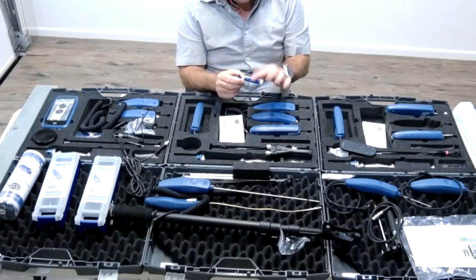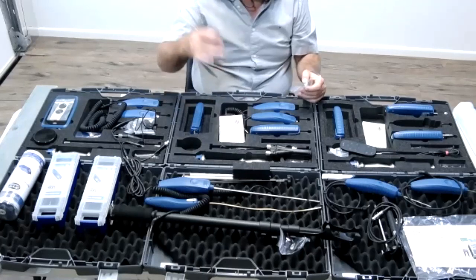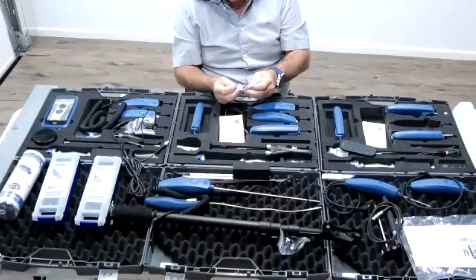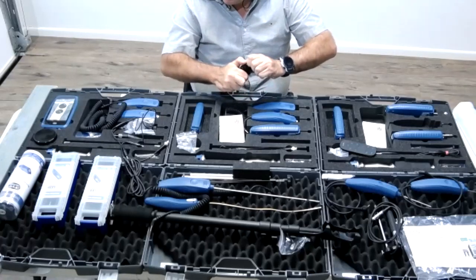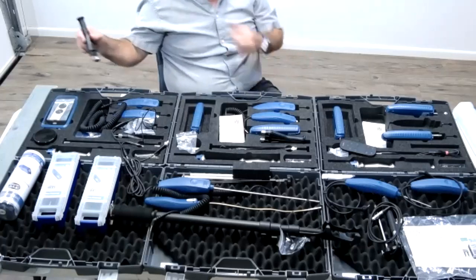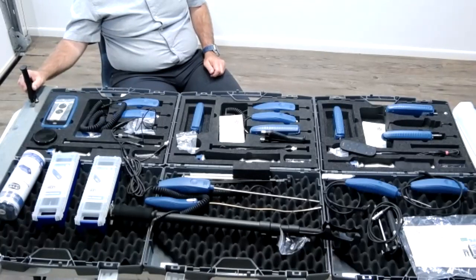You also get a handheld pin probe with different insulated pins for different building materials. The insulated pins — colored blue or green — don't pick up readings along the shaft, only at the tip. This means when hammer probing into timber you get readings at different depths — the middle and top of the board — depending on your pin choice. There are also small foam sensors that screw onto the end of the meter for surface non-invasive readings, giving a percentage reading for selected timber species, reliable to about 2–3mm depth.